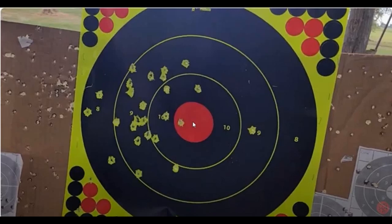These slides and frames are being manufactured with particularly toleranced margins on this subject. What that does is allow you to Cerakote things without running into cycling problems, which can happen with a tight-toleranced frame and slide. It also tells me that the frame and slide fit are not over-contributing to the accuracy of this pistol. You have a slide-to-frame fit where, and I don't want to say loose, but that would be an applicable term here — it is what it is.